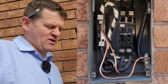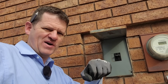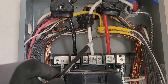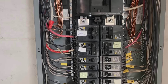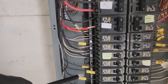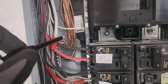I also ended up running a bare copper wire from this box over to my other box, because the metal pipes in my attic were kind of loose. If I had a bad connection there, it would eliminate any grounding I had in my entire house. With the neutral disconnected, I measured from the lug to my ground bar and I still had a ground neutral bond somewhere on one of the circuits. So what I ended up doing, which was pretty simple, was disconnecting all of my neutrals on all of my circuits and then measuring from the end of each disconnected neutral to my ground.